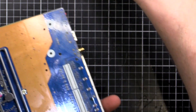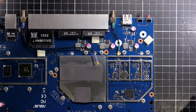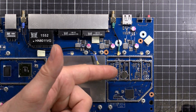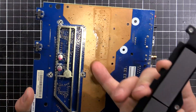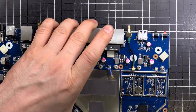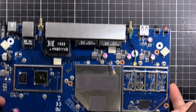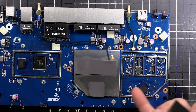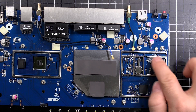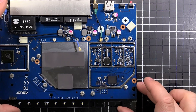When I flip it over, I've got the two caps off here. These little four sections — and there's going to be another four in there — are all the Wi-Fi amplifiers. They're going to be producing a bit of heat because they're amplifiers, so that's syncing to this big ground plane. Then this heat sink sits on there and draws the heat out so these amplifiers can run nice and cool. This big heat sink is heat-sinked through just one pad to the Wi-Fi chip, and one underneath there — there are two Wi-Fi chips. Then this big strip is getting rid of radiated heat, conducting through all of these little shield cans and borders up from that ground plane.